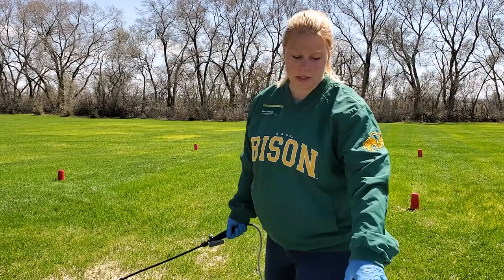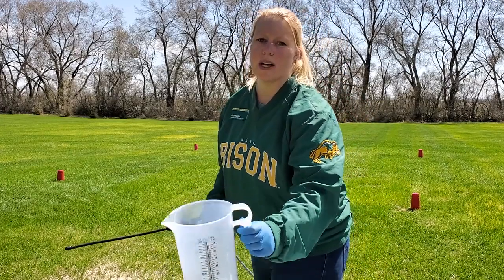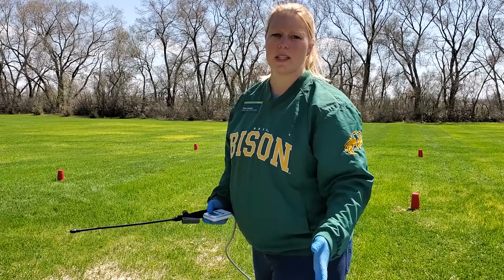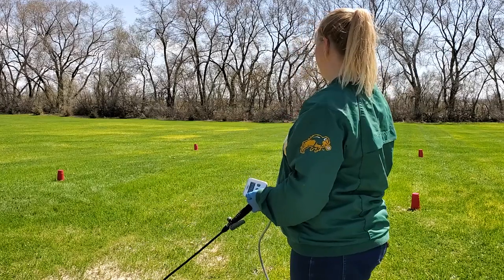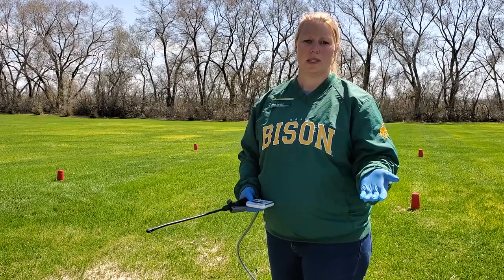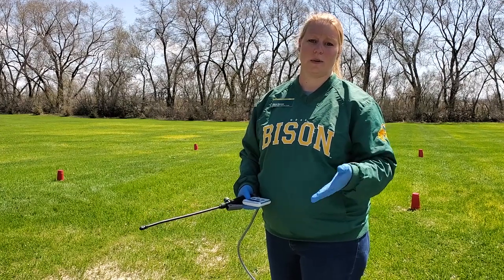Other things that you'll need to do this: you'll need some kind of a timer, and also some kind of measuring device that can measure in ounces. Once we collect the amount of water it takes to cover this area, we'll be able to break it down — the ounces collected is the gallons per acre output.